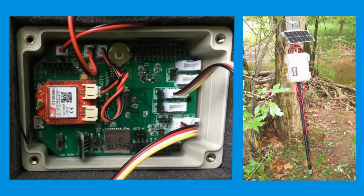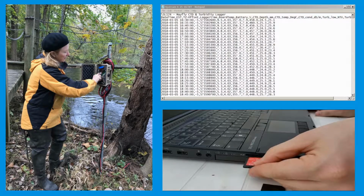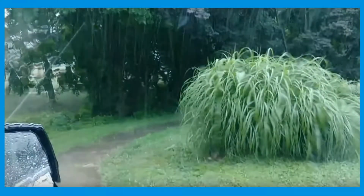Today I will go through the step-by-step process of downloading data from your sensor station. Although a fairly easy task, following the details in this process is important to prevent data collecting errors with your sensor station and breakage of parts. A reminder that this should be done on a minimum quarterly basis for stations that stream their data online and on a minimum 2-week basis for stations that do not stream online. This task should not be carried out during a rainstorm to avoid getting water into the logger box and onto the mayfly board.